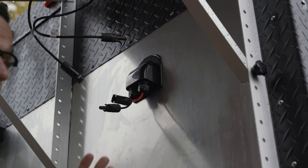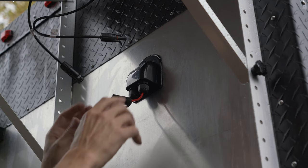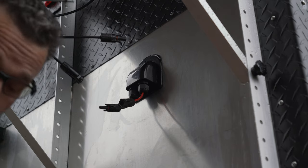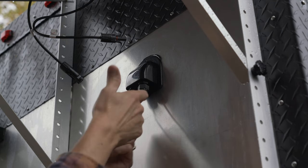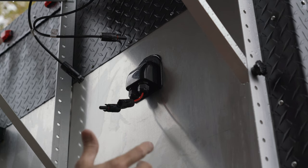I'm not going to plug these in just yet, even though it's raining and there's really no sun reflecting on the panels. Just wanted to show you how these install — fairly simple. It is important to get that crimper tool. I ended up having to buy it because I couldn't get it done properly without it. Just using it now — very simple to use and you get a good solid crimp. I'm not going to go through all this work and not do it properly.